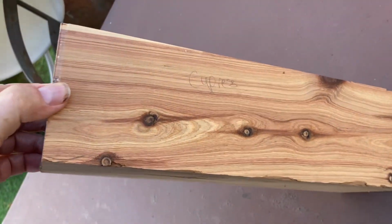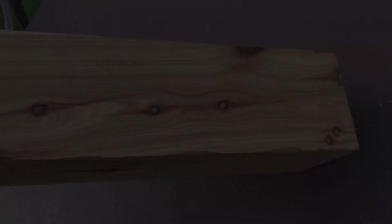Also making the stock, I'd have to take into account the fact that this is quite a brittle wood. It's very easy to knock corners off or to chip bits out of when you're working it. Freshly cut, it's got a very distinctive smell, which is probably something to do with the oiliness of the timber. Where it does come into its own is that it's got a lovely pattern and is very, very easy on the eye, very, very good looking.